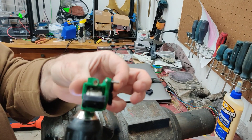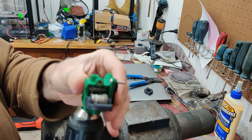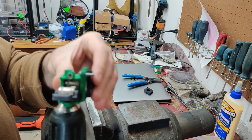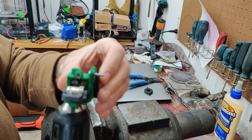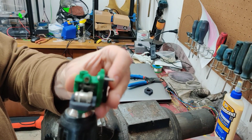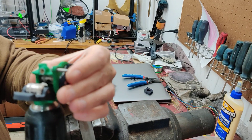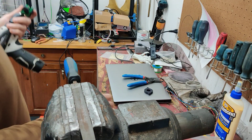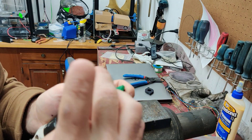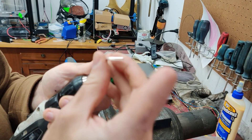It's not making contact. Now what I'm doing is turning the hob while I tighten the heat break into it until I feel it rubbing. What that does is make the hob line up with the filament path, because it lines up with the cone, with the beveled edge. Once I've got it rubbing all the way around, that means the hob is probably nicely centered. So now I can take my Allen wrench and tighten the grub screw so that the pulley stays exactly centered.